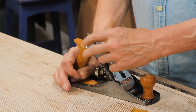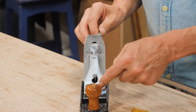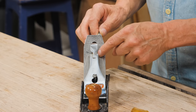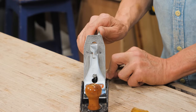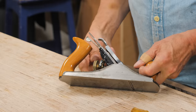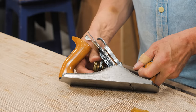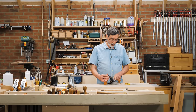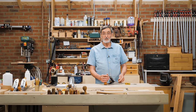I believe that's exactly where it needs to be. I see it clicked and I lock it — it's perfect. That's a perfect setting because this now gives me exactly the right pressure right at the fore edge of the lever cap, and against the back of the plane iron assembly at the top. This still allows me to tweak the adjustment of the plane and it still allows my depth adjustment wherever I want it to go. So that's what this is for — this is not to cinch it down. It just allows for adjustability.